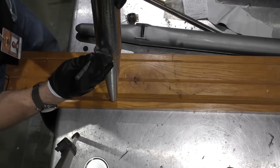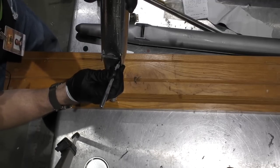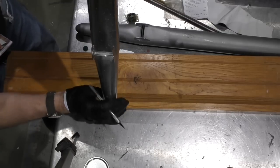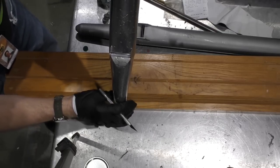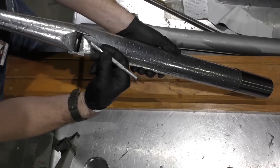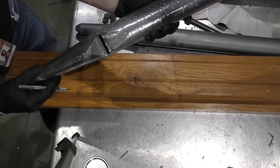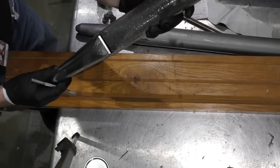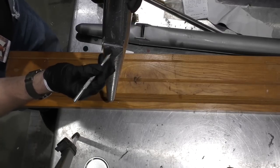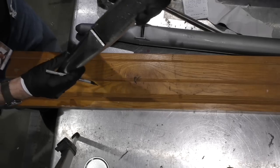This is usually considered part of the finishing process, but back in the 20s and teens, it was part of the pre-voicing process to put the nicks into the languid like that. Now the other thing I need to do is to skive the upper lip, that is to put a bevel on it, which is difficult just because of the tools I brought with me, but I'll have to do that on the 3 pipes. So I'm going to go through the other 2 pipes and put the nicks in the languid and then skive the upper lips, and then I think they're ready to be put on the voicing machine.